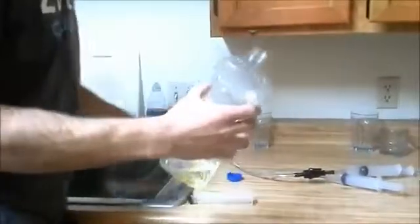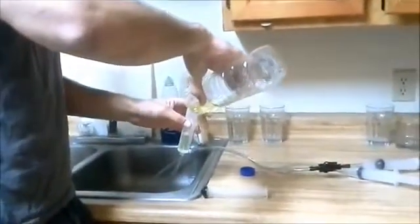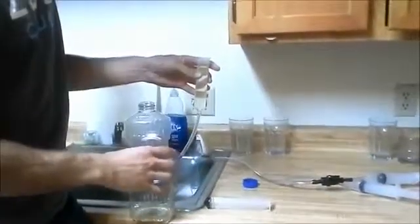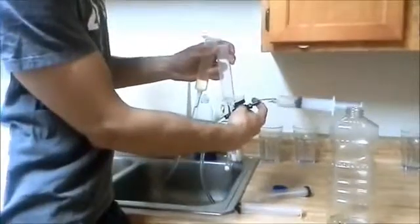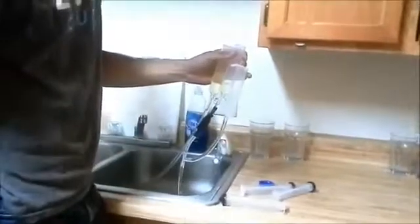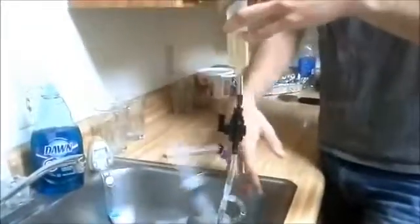Here's how we fill the oil. We remove one of the stoppers and pour oil into the syringe. You'll see as it fills up, you're going to have to take some time, and it will slowly lower down the volume. If you want to speed things up, hit the other side and suck air out of the other syringe. Make sure that your ball valve is in the on position as you go — if it's in the off position, you will not be able to fill it. Release all the stoppers before you go. Now that I've oiled the cylinders, I'd like to try and get as much air out as possible, so I'm going to remove one of the syringes, even though there's air in this one.